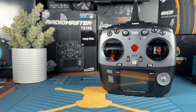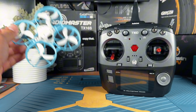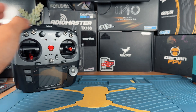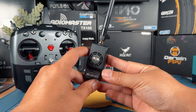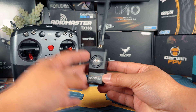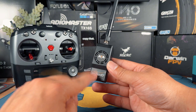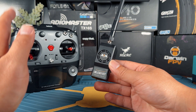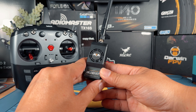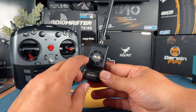So potentially, besides your regular RC planes, you will be able to fly one of the FPV drones that basically the Betaflight ones. To make the T16D compatible with ExpressLRS, you are required to get one of the external modules. This particular one is the ATA Hobby ExpressLRS module, which came with a kit they provided me. But if you want to just buy any kit, you can get any nano-size ExpressLRS module and it's basically going to work. Also, a little note: make sure you get the one that says 2.4 GHz instead of 915 or something, because that is going to be the major protocol that most of the Betaflight FPV drones will be using.